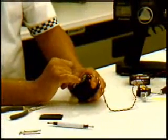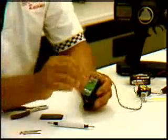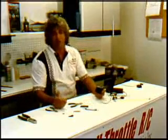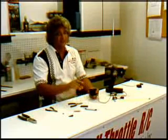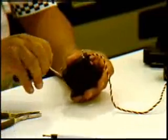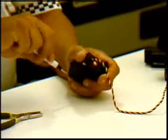Salt water is a whole other issue — salt water is such a good conductor, you get what they call electrolysis. If you get a servo damaged in salt water, most of the time — I've saved a few — if you can get them quickly enough and get it out of the water before the component is on and in the salt water, you have a chance. Generally, in fresh water, almost 100% of the time you can make these things work again. Salt water is iffy — try it, don't give up. Let's put this back together. We have the rubber seal on there, then it just requires putting the four long bolts back into the case and tightening them up. You're only going into nylon, so don't over-tighten it. Once you feel them bottom out, give it a little bit more. Watch the seals compress — if you start seeing the seals squeeze out with a plastic bow, that's a good indication you're too tight, because after that it's stripping.